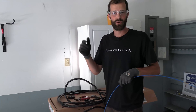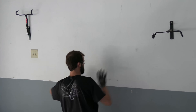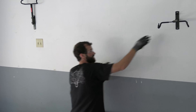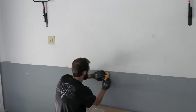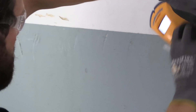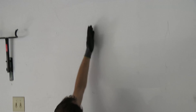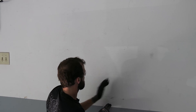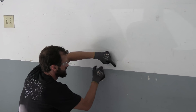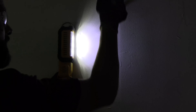Time to head to the attic. Cliff is going to drill a hole and fish the fish tape down to me, and my goal is to get the end of the wire hanging out of the wall. We've got bike racks on the wall, so we're putting the NEMA 14-50 outlet low to avoid the bikes, per the customer's request. Using a stud finder to locate studs, I'm also going going vertically to make sure there are no obstacles in the wall. If you don't have a stud finder, especially in the garage, you can look for nail pops — there's one right there that lines up with a stud, and the next stud should be 16 inches on center. Using a flashlight laid along the wall, you can also see the vertical seam between two pieces of drywall right on the stud.